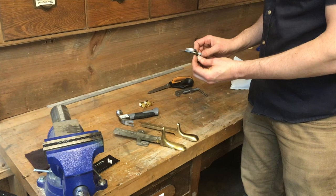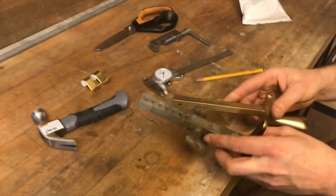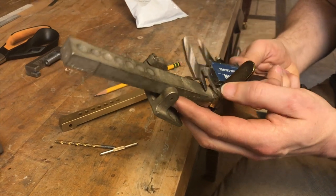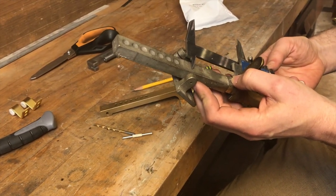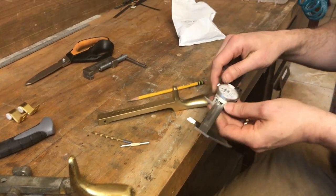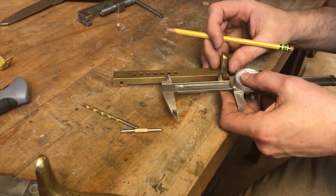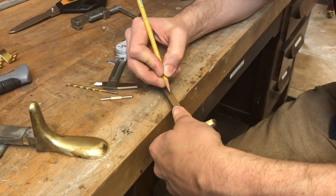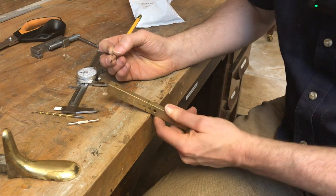So let's find a drill bit. The crucial dimension here that we want to duplicate is from the back of the horn to the center of the pin. It looks like it's right about there — doesn't really matter what the number is, we're just going to duplicate this. But the number happens to be almost exactly 3 inches. Let me make my little crosshatch for the pin drill.